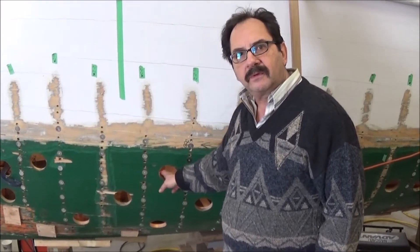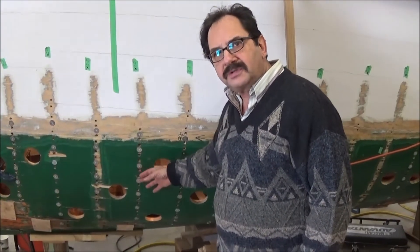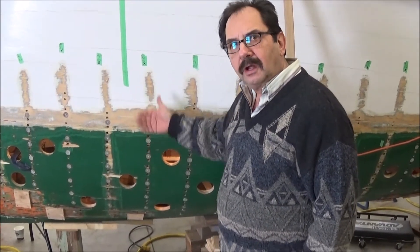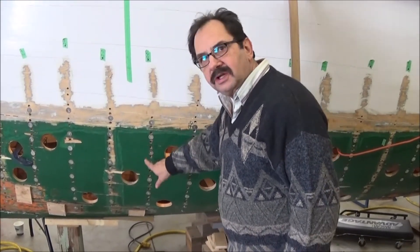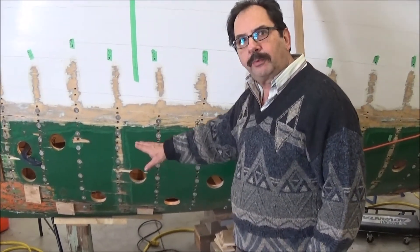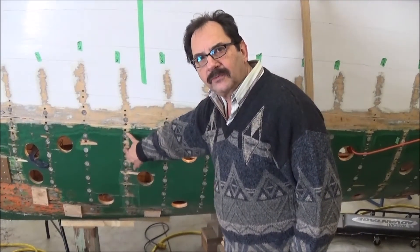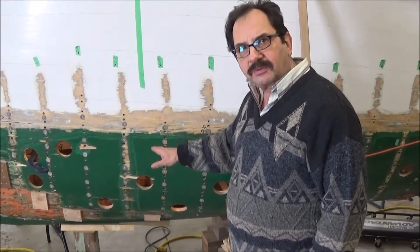The holes also hold the clamps. When the clamps go in the boat, they hold the ribs to maintain the memory of the hull. Once they've held the memory and we've glued the new rib into the old rib's place, we scarf them in and epoxy just the scarf itself. Once the scarf is in, we put screws in just to hold it to the hull. Later on, when we put the new planks in, we pull up two planks, work on the top plank, then rivet them back into the boat — so those screws disappear — and we have a new rib to rivet to as we carry on.